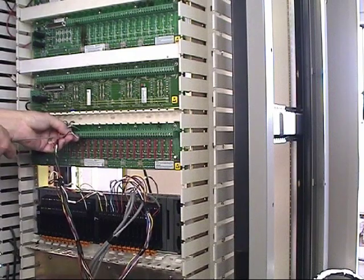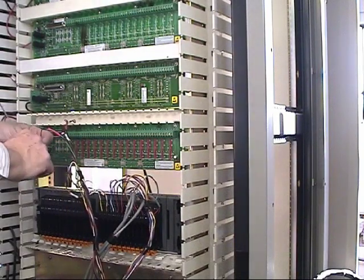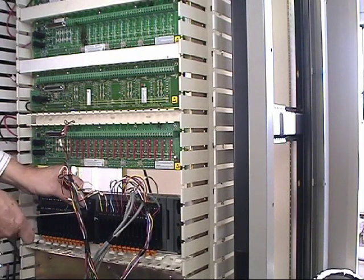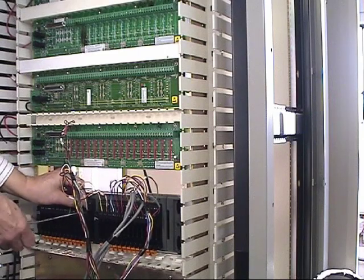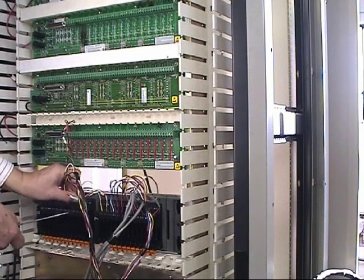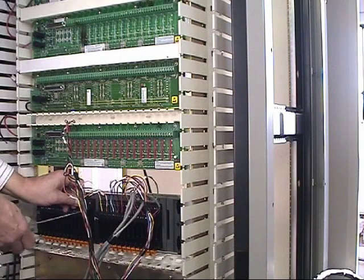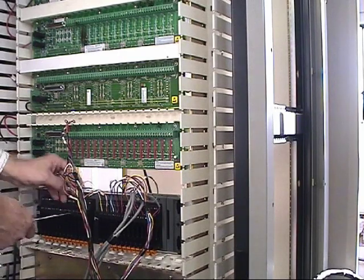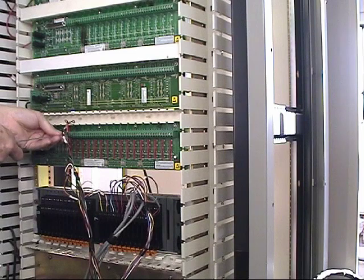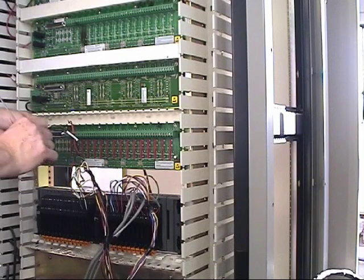Provox accommodated anywhere between 8 and 16 I/O depending on signal type — most signal types were 16, while analog outputs and pulses were 8. The Charms racks accommodate 24 I/O. If our next panel were an analog output panel, we'd be able to start those analog outputs with the remaining channels in this Charm holder, because of the single-point I/O capabilities of the Charms technology.